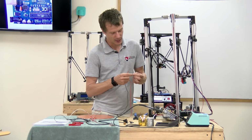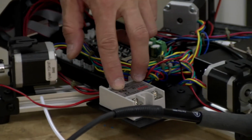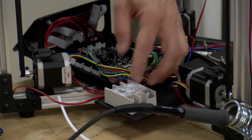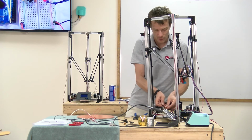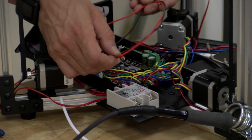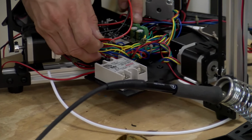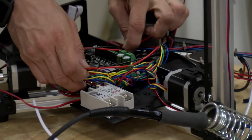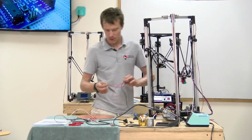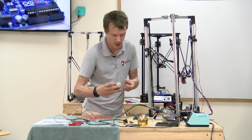And this is the control side. The control board sends signals to this relay that turns the 120 volt AC side heating element on and off, basically. So we'll have two wires that attach to these terminals and run back to this tall heater screw terminal jack right here, like so. So I'm going to prepare these wires by tinning them and cutting them to length.